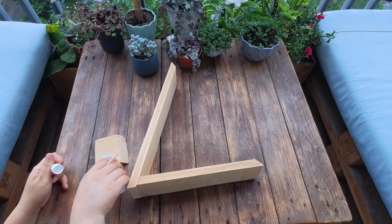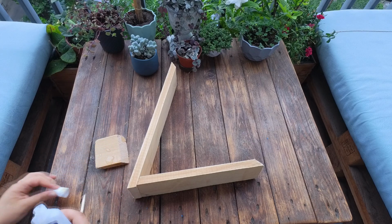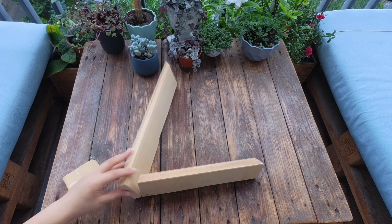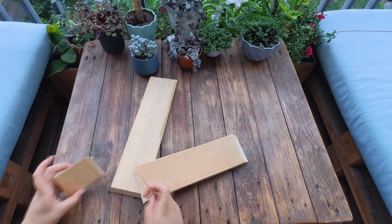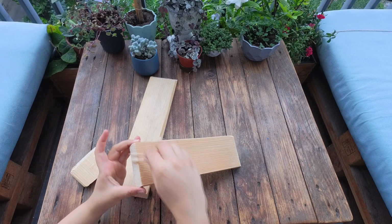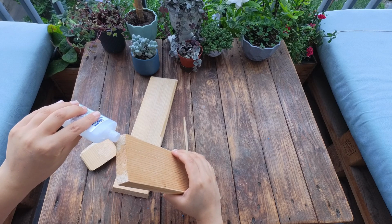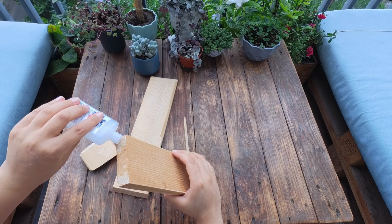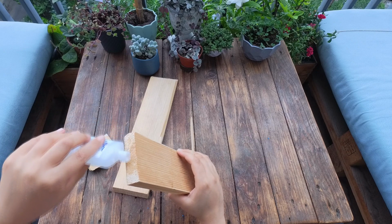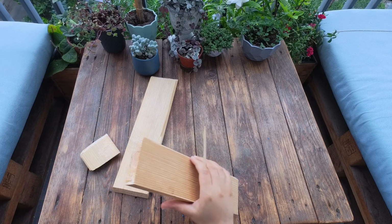But I'm sure that with the right saw it would be a matter of seconds to cut all the pieces. I cut the wood at a 22-degree angle for the parts where those two pieces needed to connect to have a nice corner, and at a right angle, and cut the ends at 45-degree angles to have nicer edges. I'll include all the measurements of this piece in the description box below.